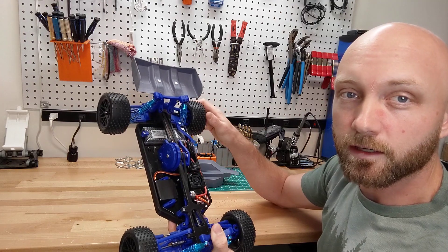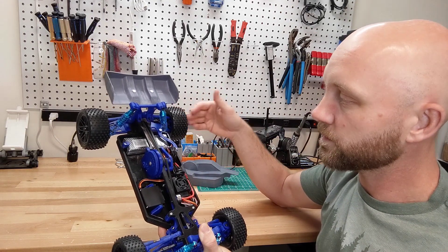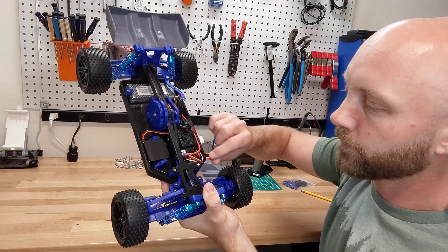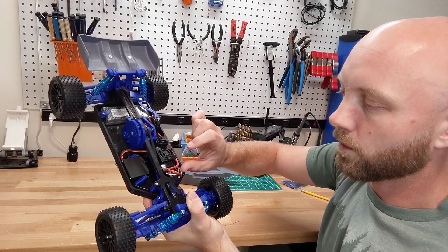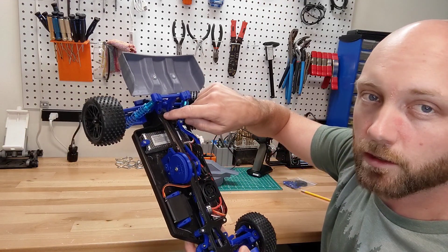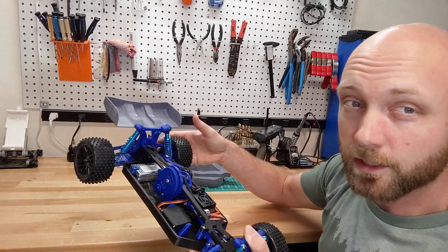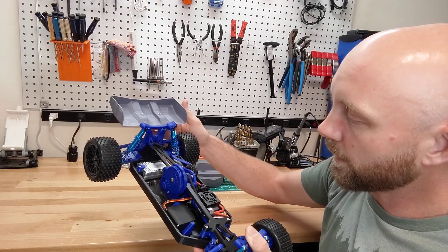The belts at the back and the front attach to open differentials, and they're 3D printed open differentials which seem to work quite well. The wheels can spin independently — they don't need to spin together. The belts also have tensioners built in. You can see the front tensioner right there; you just loosen that screw and the bearings can be oriented slightly more downward, then tighten it back up. There's another tensioner in the back that you tension from underneath. The designer recommended using these steel drive shafts, which are really easy to find online and inexpensive.